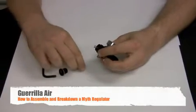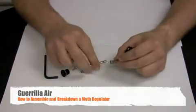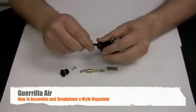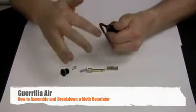So you have your top flange, you have your poppet, here's your poppet spring, you have your piston, your regulator spring. At the bottom there's also a seat retainer. Take the same allen key and undo the seat retainer until it's loose.